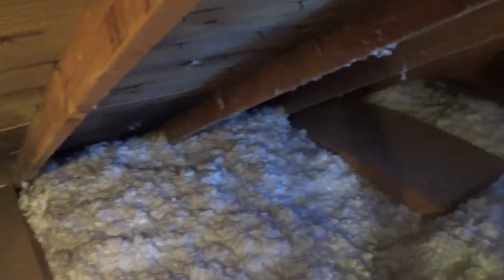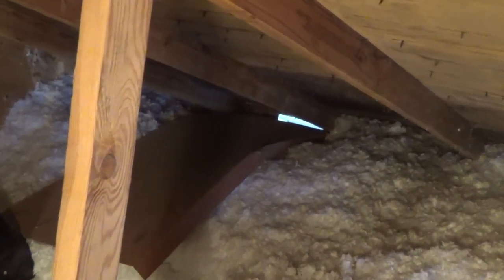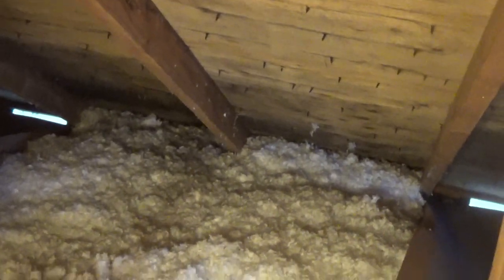I'm going to move these things away, make sure we get nice exposed vents so the air will come up here and exit there, and you won't have this stagnant warm air that can condense water. I did readjust some of these cardboard spacers to open up these vents, and I could already feel the air circulate a little bit better. I bet you anything if I come back in a few days to a week, a lot of that wood will be much drier and I probably won't see little dew drops on these nails. Basically I've opened this up so air will circulate and flow in and out through the upper vents.